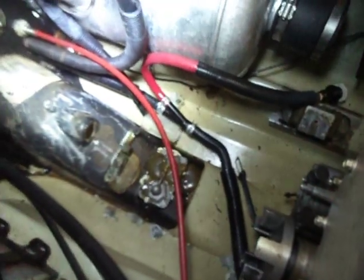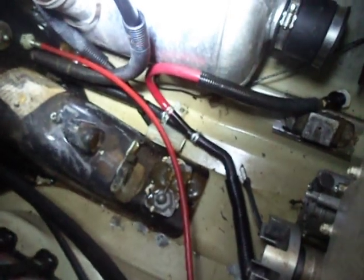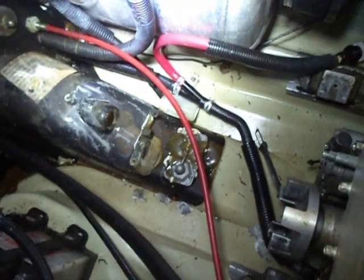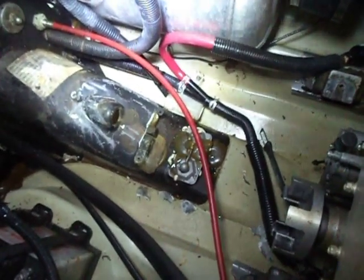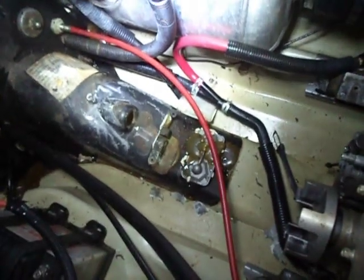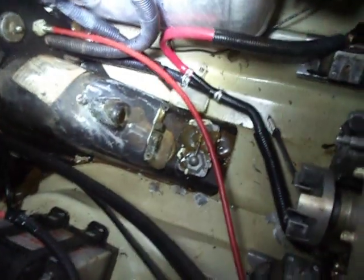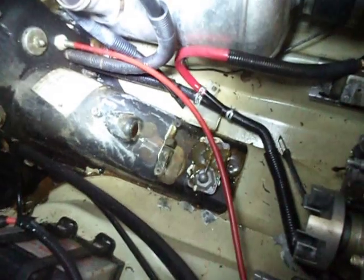Total time involved — I'm a licensed mechanic and I've worked on just about everything, but this was completely different to me, similar to working on an old car with seized bolts. You have to heat up seized bolts; they won't come out otherwise. And to remove adhesive you have to use heat — that makes your job a whole lot easier.